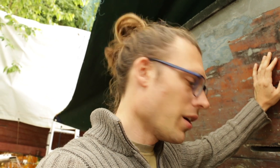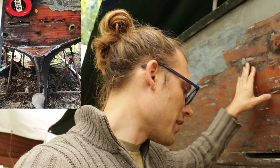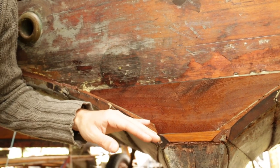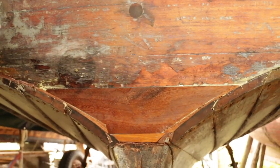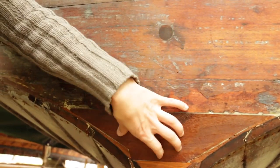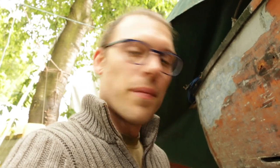The more I was cutting it up and sanding it, the more of a mess I was making of it, to be honest. So I gave all the bits of wood to one of the boat builders in the yard here, and he glued them back together and did a little bit of trimming, and he came up with a system to make it fit, whereby these two here are wedges that have changed the shape of that hole from this way to this way. Which is kind of difficult to describe, but it basically means this big bit in the middle, the inside face of it is much smaller than the outside face, so it can just be pushed in as a plug. So, pretty good solution actually. I don't really know why I didn't think of that, but you look at these things in hindsight and you think that's actually really simple.